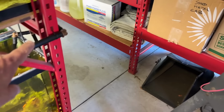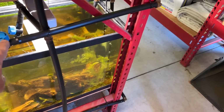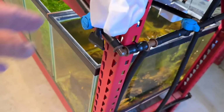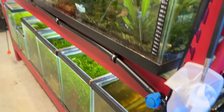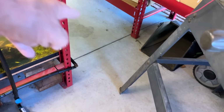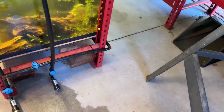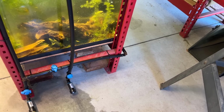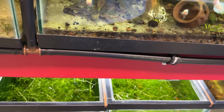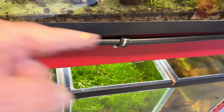Let's come around to the end. And here's what I did extra. So the drain from this side comes around here, and I threw another valve on here. That way it'll just stop the water to this point. And then I threw another valve on this side. Same thing, just stop the water. And then across the bottom, I stuck another valve down there, it keeps the water in the main part of the line. Now, above each one of these valves, if this line drained, this would still stay charged from here to here. So I'd still have a siphon as soon as I opened this to the other end.